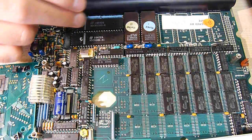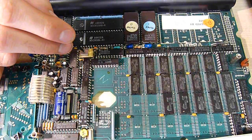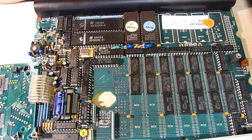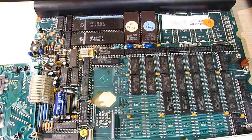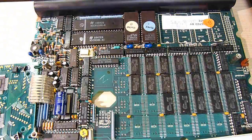This chip here is just its I/O chip. And this is its main crystal oscillator, which looks like it's clocked at 8 megahertz. The Husky runs at around 8 megahertz, and due to it being a battery-powered device, if you watch the EEVblog you've seen it runs in bursts of clock speed — every few milliseconds you get a burst of clock and it only engages fully when it needs to.